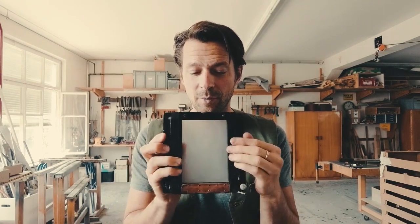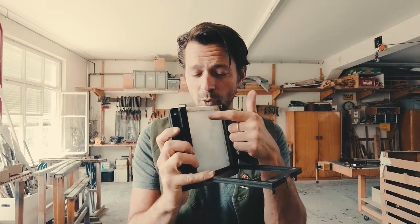Our focusing system can look a little bit daunting to assemble, but it's quite easy if you follow our step-by-step instructions. Really important is that you put in the sanded glass with the sanded side to the front, because this is where you will put your paper so the focus lies exactly on that sanded part.